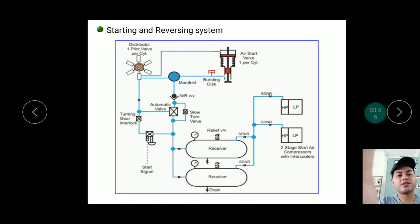After the turning gear section, there is a pilot valve or distributor that distributes air to the correct cylinder. For example, if the engine is at top dead center on the power stroke in cylinder number 5, it injects 30 bar of air into that cylinder to push the piston down until the engine rotates. Then the next cylinder in the firing order — for example, after 5 comes cylinder 2 — that one receives the air on its power stroke.